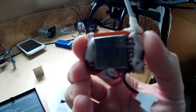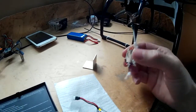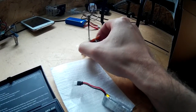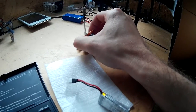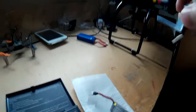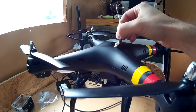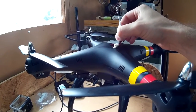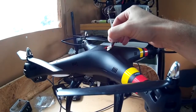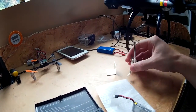Because the transmitter on the back gets hot, I'm going to put some heat sink compound on there and then mount it to a small piece of aluminium which will serve as a heat sink and also a way to mount it on top of the quadcopter. I can just wrap a cable tie or velcro tie around it and sit the battery on the back.